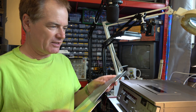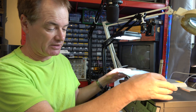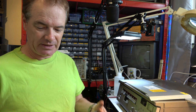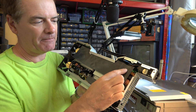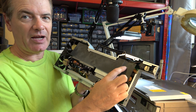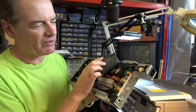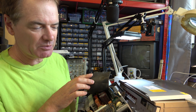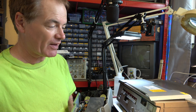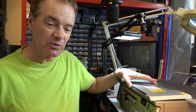Really quite a mess. I fought my way through the label saying no serviceable components inside and dismantled the power supply — it's now in a semi-dismantled state. A bit of the insulation had been burnt up by the capacitor underneath it. It was a 2.2 microfarad X2 rated safety capacitor. No other damage seems to have occurred. I didn't have that value in stock — I've got some smaller ones — but I thought I should fix it properly, so I've ordered one. No doubt that'll work when I've replaced the capacitor.